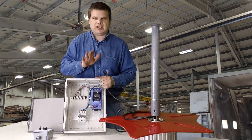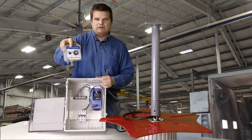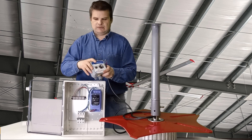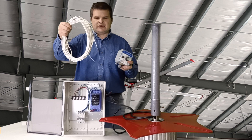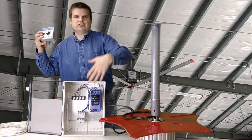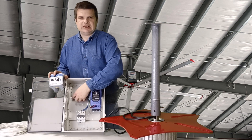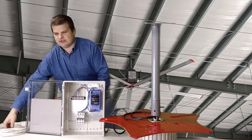This does all the soft starting. If you have a manual control, this is the VSDM1 — which gives you forward, reverse, slower, and faster. This gets connected with a control wire that you supply to the variable speed drive. One of these can do multiple fans. There's no power in the control wire — it's just low voltage — and it connects through these terminals down to your VSDM1.